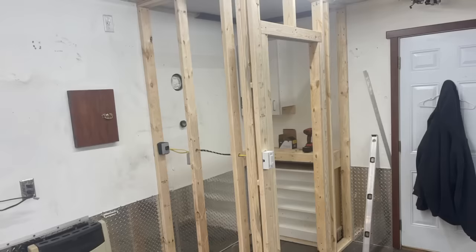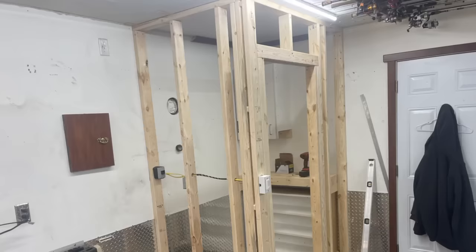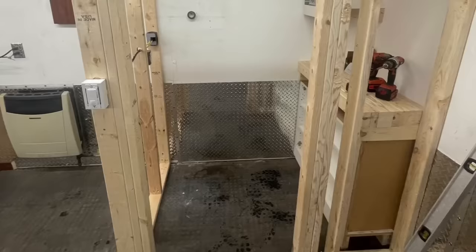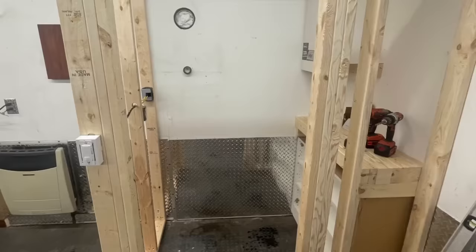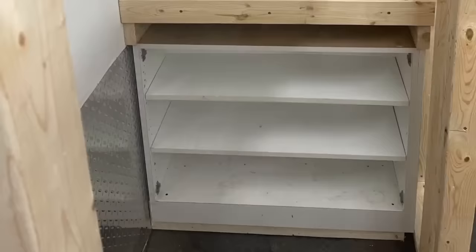You can see I've got some wire running through the wall there. There was a motion-activated light switch in that location, so putting the wall there, I had to relocate that and subsequently allow the motion-activated light to function properly. Here's just another view of the five-foot section of the wall. This door is a standard 30-inch door, 80 inches tall. I did not buy a framed door, and you will see why here later on. Basically what I ended up putting in here was just a slab door blank.